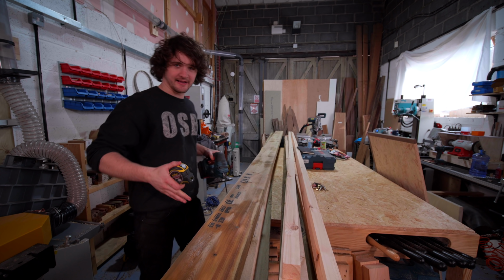We've then got a longer one in here somewhere, which is this one, 4.8 metres. And this will be cut down to 4.4, which will make the handrail at the top of the balustrade. I think there's another word for the uprights, and then the balustrade is the horizontal bit, I think. But never mind. These are what fills the frame between the uprights to ensure that we don't just fall through there. We're going for a horizontal at the bottom and then 3 uprights within them. This is going to be dominoed together and then dominoed within the frames as well.